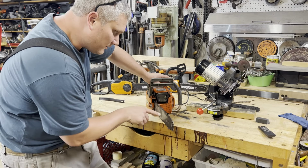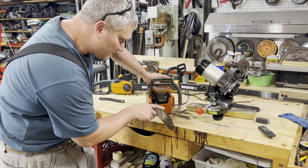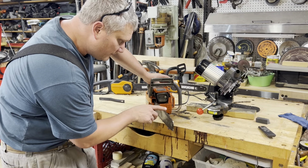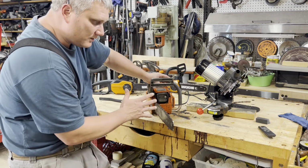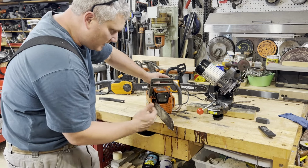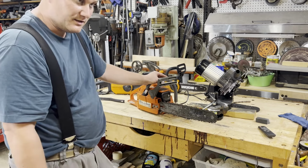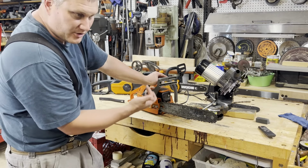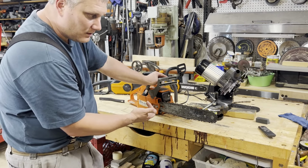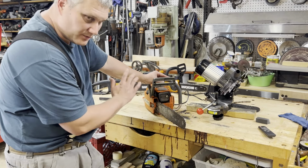I don't know what I did before. Some of the teeth were different length, but these ones are pretty even, and it's noticeably super sharp, and that angle works pretty well. So, that's just my long explanation of my simple honing, a little bit of extra honing, and make sure you get the tooth all the way clean, and then you're gonna have a super sharp chainsaw.